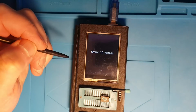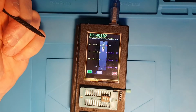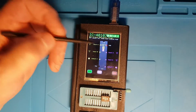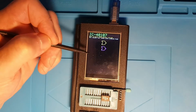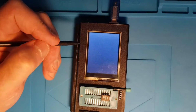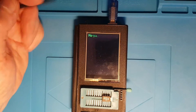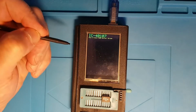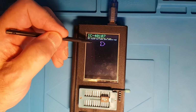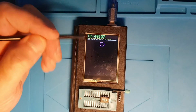Okay, so something else that was on there, just to show you, 40107, a couple of things. We've now got a key in the center of the chip here, which shows us what the individual colors are in terms of which element they relate to, and we can actually poke one of those and it will show you this diagram where it's showing us the actual individual elements on the chip. And if I actually poke the right area of the chip, I can go and look at element 2, and it just shows us element 2. Now this view will include the pins that are associated with this element, and we can then manipulate those manually rather than doing it on the actual physical layout of the chip. So that's a bit more sensible.